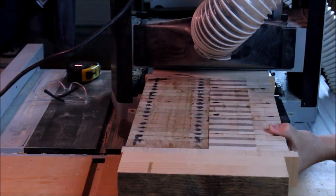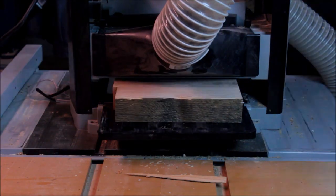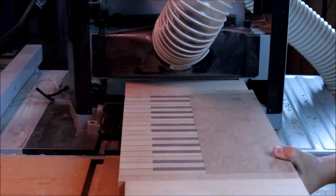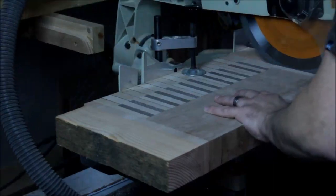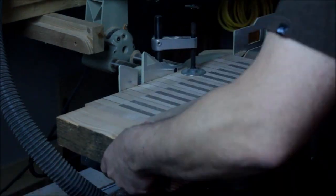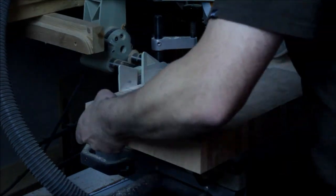I'm doing all the rough planing with old blades, and then I switched to brand new blades for the final passes with micro-adjustments, because it's end grain and really hard on the planer — it takes a lot of passes. Once everything is done, I cut off those temporary end blocks and make sure everything is square and nice.